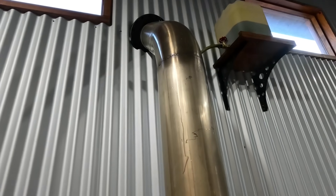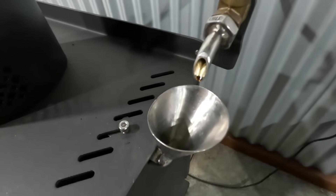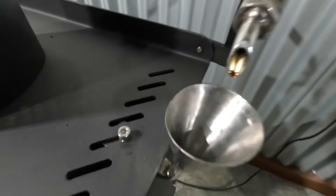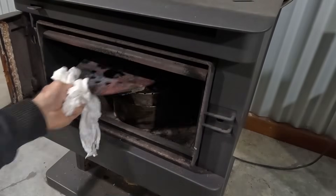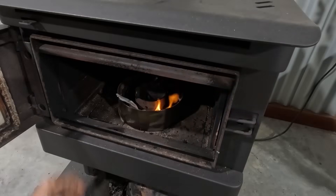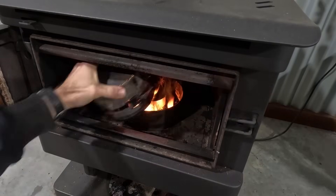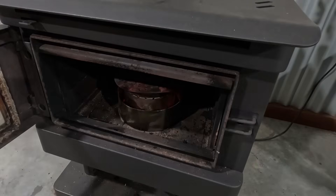This is a six-inch flue. The first section up until it goes to the wall is actually tubing that's two millimeters thick. I still use kero to fire it up — I think it's easier. Normally when I light it I just have it straight in and use max gas to fire it up, but I've run out of gas. So to make it a bit easier I'll just quickly pull the top off, light up a bit of tissue paper, stick it in there to get it going on kero, and put it back together quickly. In this design you need the door shut — that forces all air to come in the bottom, and as it gets hotter more air pulls through.